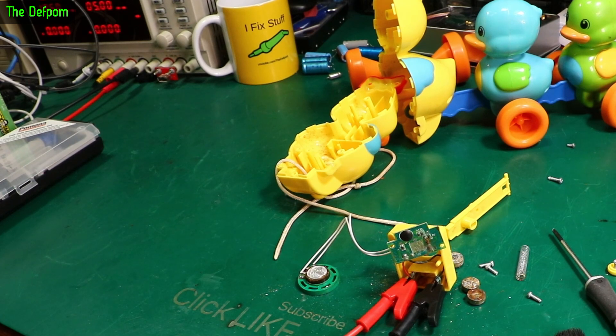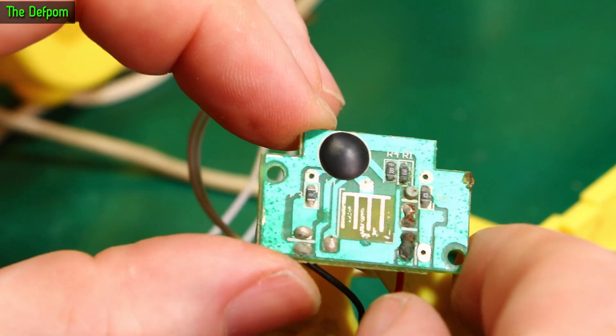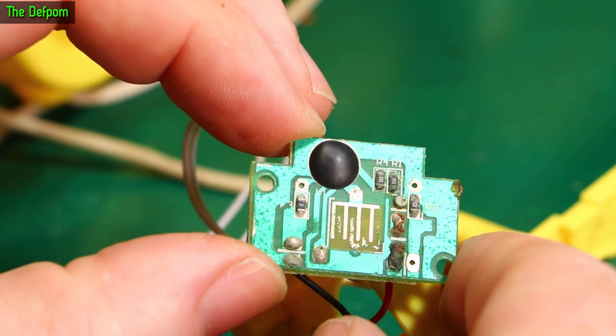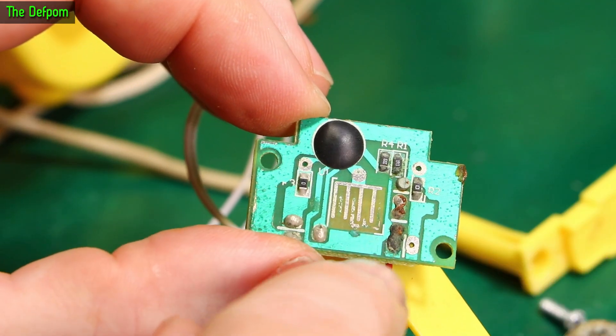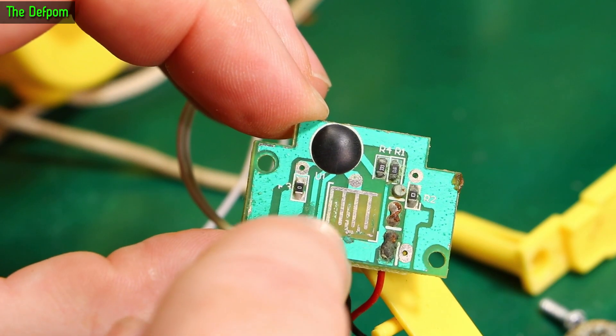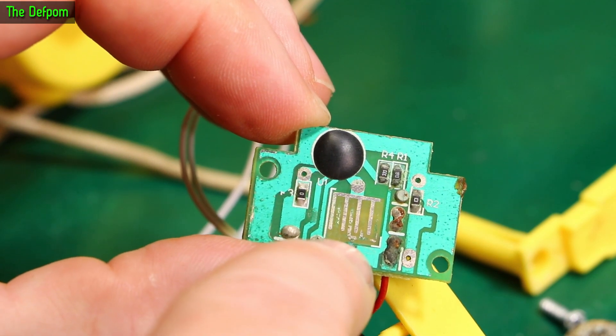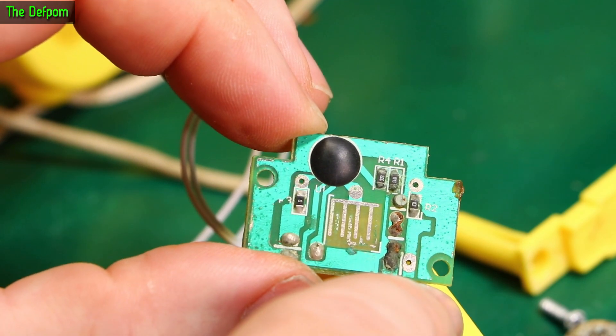She's dead. So I was giving it a clean up with some IPA so we can see a bit more detail about what's going on. You can see it links this large pad, which had these little forked bits in between those contacts there, onto this pad here. So shorting between this pad and that pad should do something.